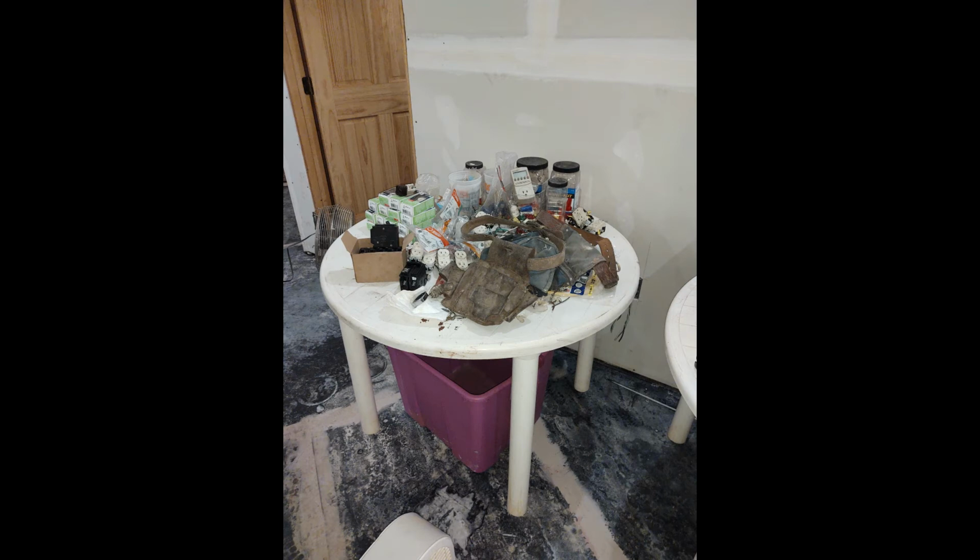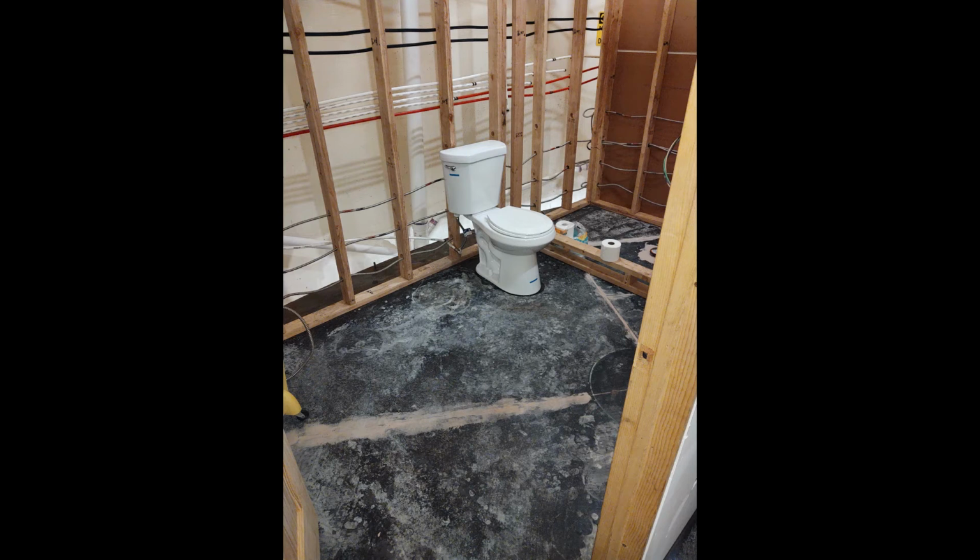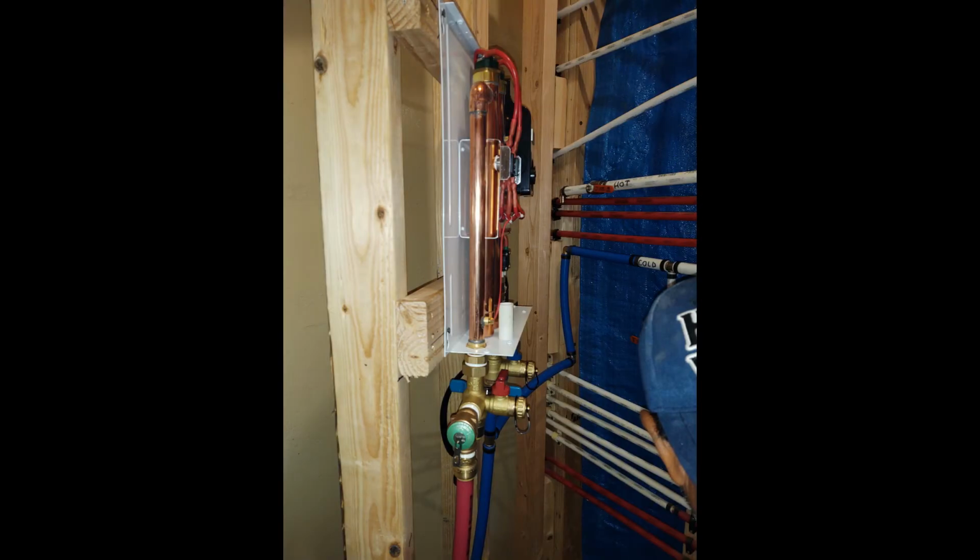And later on, when we finish these videos, I'll take you through the redundant properties I built into this particular site. Just a quick example: from above ground, we've got an emergency backup generator that has an automatic switch. The second it senses a power failure, boom, it comes on, it's running. It's really nice, so we never ever have to worry. We've got emergency backup lights, and at the end of the day we have signage that you can literally see your way out of the site, and it lasts for about 45 minutes from the time power goes out.